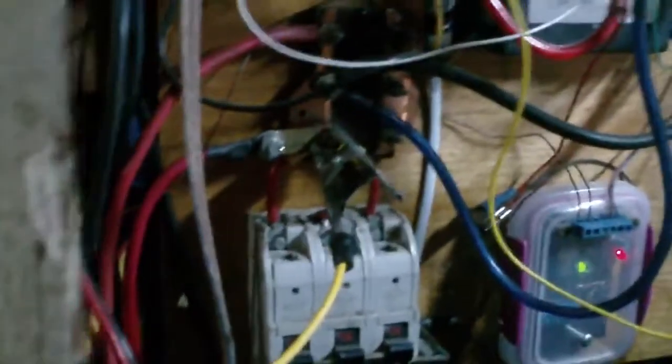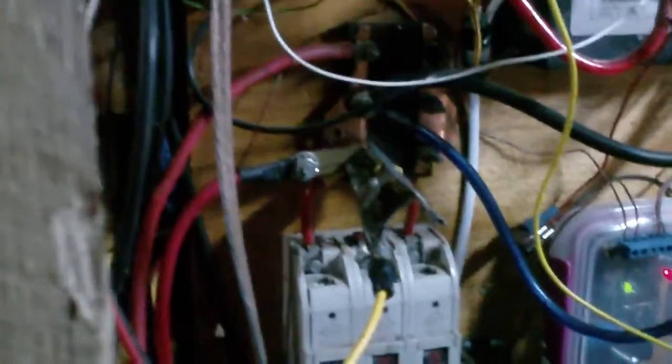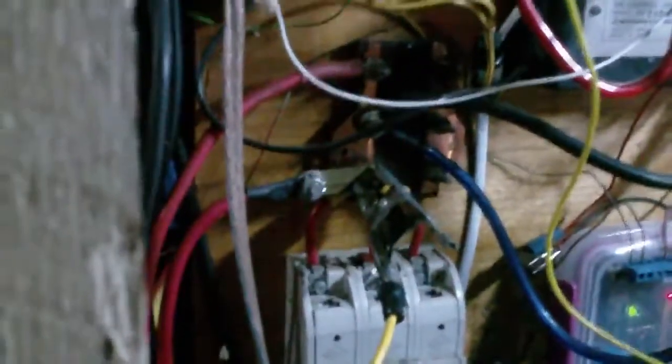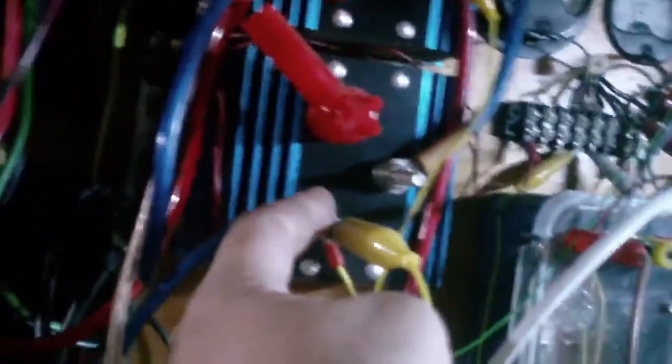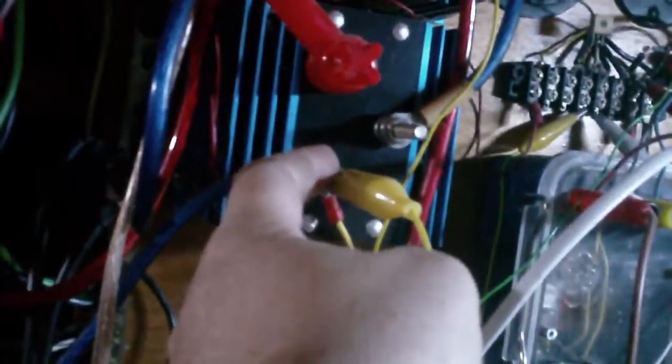Now this creates an interesting situation, because now the voltage that this point can get to is far more controlled. It's only ever going to be, you know, up to about 14.4 or 14.5 and down to maybe 12, and not any lower than that, rather than the sweeping range that could be up here on this terminal, because it could be anything from nearly 20 volts when the panels are lightly loaded down to the lowest battery voltage that the system is seeing.